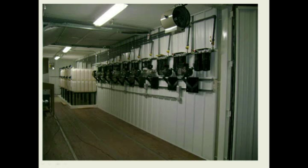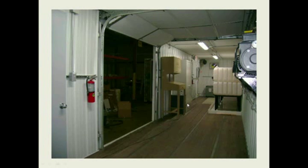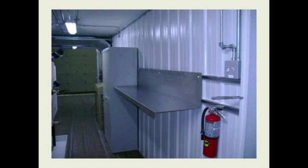And then this room was air conditioned, as you can see here, got a couple heaters in it, and they were able to bring the barrels in, and they could actually store some barrels in here and keep them warm and keep them out of the environment. But a very nice lube storage room with a cabinet, and so these are some of the things you want to look at when you're designing your room. What all do you need in there, and what all are you going to keep in there? Some workbenches and cabinets where they can get some work done. Spill control underneath the containers.